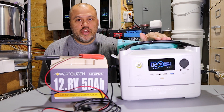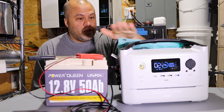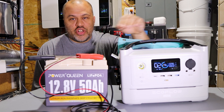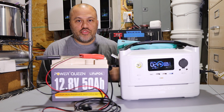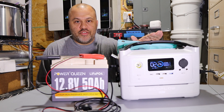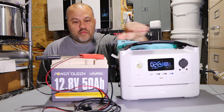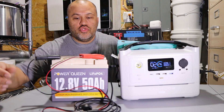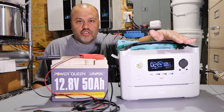If you want to double your power — even if you have 500 watts coming out temporarily or 200 watts — you're still going to run a lot longer. Say you've got 200 watts coming out and 100 going in: it's basically going to take twice as long to get to zero because it's effectively only 100 watts net draw. Especially if you have something cycling on and off — like a 200 watt personal heater, a CPAP machine, or anything around 70 to 80 watts — you'll basically run twice as long. Keep in mind you can only get so much power out at a time due to the wire size and maximum input on your 12 volt adapter, but there are definitely other ways to do it. It's great for smaller units to double their capacity.